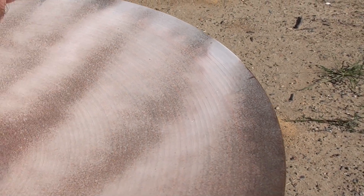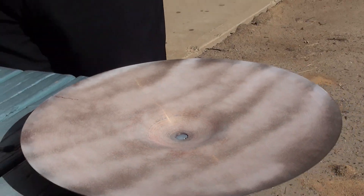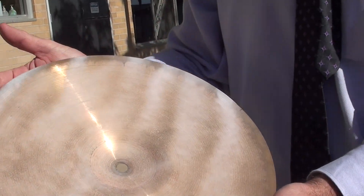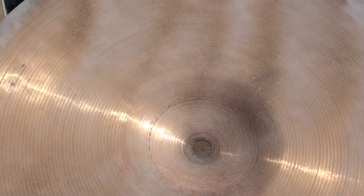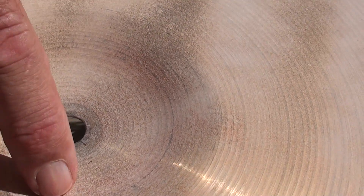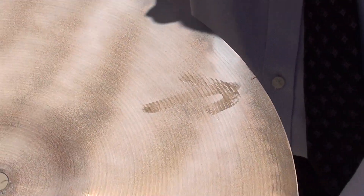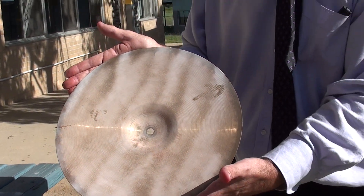As you can see — if you could zoom in on this — you can see the crack there. As the chalk's drying, it's starting to draw out the dye. It's showing us there's another crack here on the edge that it's picked up that we couldn't see with the naked eye. There are two cracks on the inside of the sample. Dye penetrant — we could see the one crack on that sample, but there's actually five. You can see on the inside of the boss there's three cracks on the inside that the dye penetrant has picked up — one, two, three. And then there's another one over here. So that's found five cracks in that sample. That's where dye penetrant's used. That's what the dye penetrant test is.